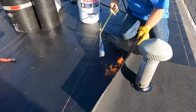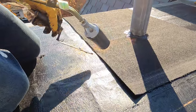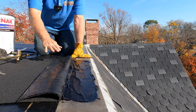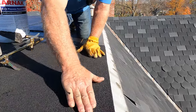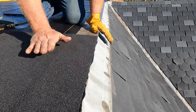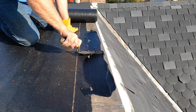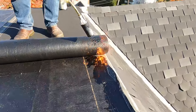Take the membrane and you melt it to the base — that's it. A nice thick coat of Karnak, really burn the plastic off, and all you do is stick it and squeeze it down until you see it ooze out of the edge. Get it lined up, then I put a nice bead of Karnak down and burn it slightly so the plastic is off.